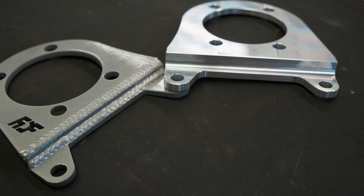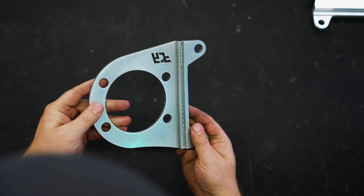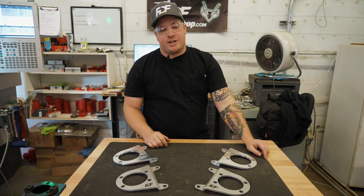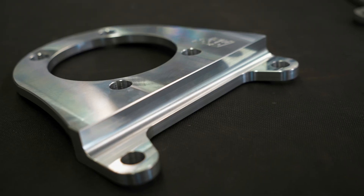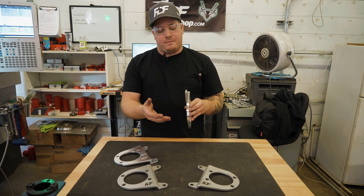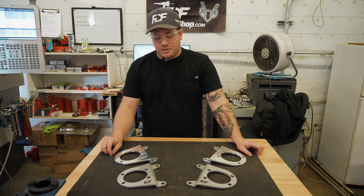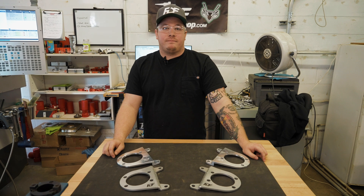Here's a pair of our previous design — the steel welded ones. Honestly the biggest difference you'd notice is the weight; the aluminum is much much lighter than the steel. Personally I think the billet finish and billet construction looks a little bit nicer — kind of a shame it has to go in the suspension. The billet bracket is going to fit the same way, use the same spacers with the OEM caliper in the OEM position to just space it out. It'll work with the Brembos and the non-Brembo calipers as well — just a nice lightweight aluminum upgrade.